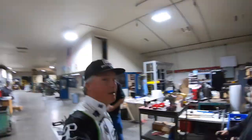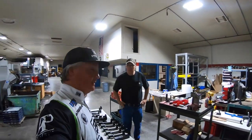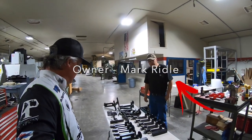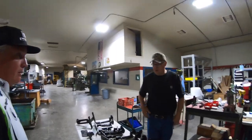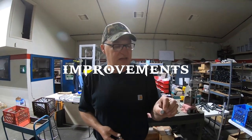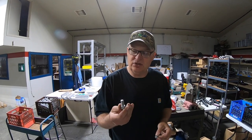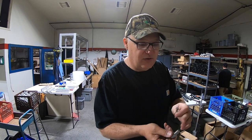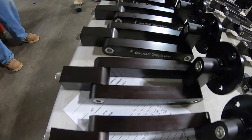You guys remember Mark — we got Mark and Nate. Check it out, this is the new setup we talked about earlier. This is our new style; we kind of upgraded the mounts a little bit. We went from a 3/8 stainless steel hex head bolt and redesigned everything to use a half-inch allen head bolt. This is by far a heavier bolt, and we went to fine thread for stronger threads.